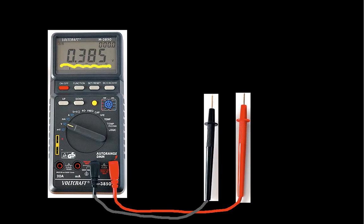One is the display. You can see that the display shows, in this case, I think a measurement of voltage. It has the dial which selects what you're measuring. You'll notice right now that we're pointed at the V, which stands for measuring voltages in the 1 to probably 100 volt range. I could also take this dial and point it at mV if I wanted to make accurate millivolt measurements. This multimeter will also measure current if I point it to A.